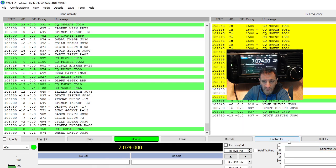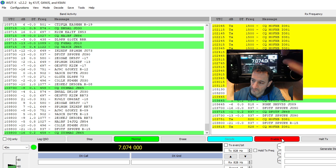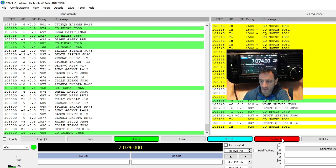Looking at device properties, the volume seems about right — roughly halfway up. Let's enable TX. We're getting a green signal there. You can see the ALC come up and it goes to where I like it — just one bar showing — then it vanishes. Let's let it go on the next transmit. That held a bit better now. I haven't changed anything. It does eventually vanish. I'll let it run for about five minutes at the full five watts.